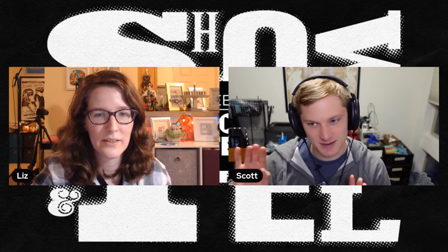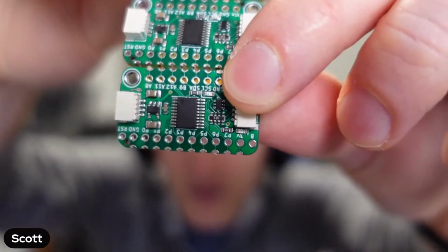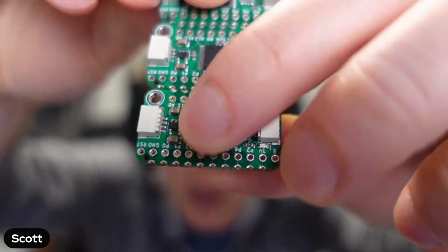I wanted to rework the API for it, and now I had to figure out how to test it. And this idea of having some helper code on another processor with CircuitPython has been kicking around in my brain for a while. I developed these STEMMA QT boards here that have Cortex M0 pluses, the STM32G0s on them. So this is another thing I've been thinking about, where you have some code running on another processor that CircuitPython is working with, similar to the ULP on the ESP chip.